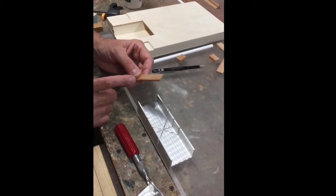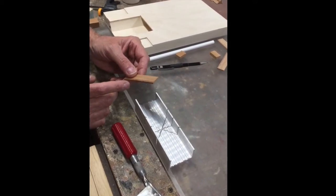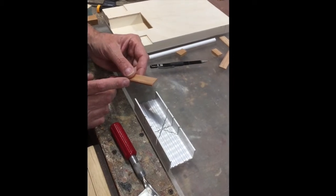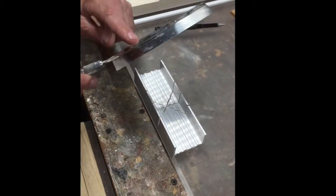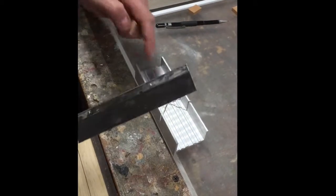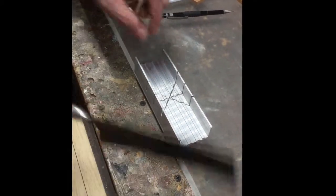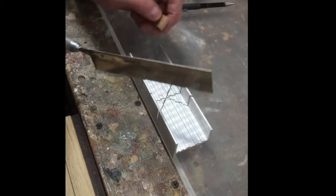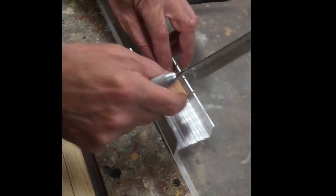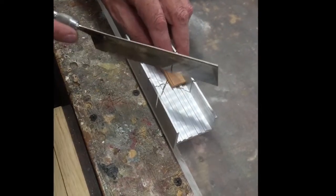All the trim, with the exception of the cast resin pieces, is made out of cherry, and cherry is a hardwood, so I would strongly recommend running out and buying a brand new X-Acto or Zona razor saw, new and sharp, and a new miter box. Miter boxes have a tendency to wear out. They get sloppy in the grooves. Cutting cherry wood is not much different than cutting basswood, except it takes longer. It's hard wood.